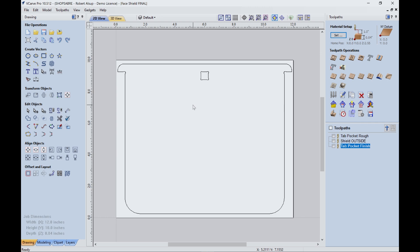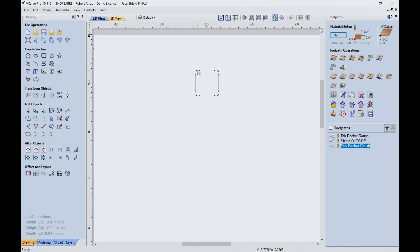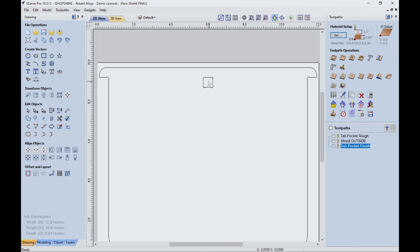Here's the actual shield drawing and I want to tell you about tooling. If it's materials you're not used to using, I call Vortex, tell them what I'm trying to do, and get their recommendation. The first thing they told me was on this thin material you need a straight cutter — not an upshear or downshear. I decided to use a 3/16ths tool and try to keep the cutting edge as short as you can get by with. But for this inside area, it has to fit that part of the ring, so I needed an eighth inch tool.